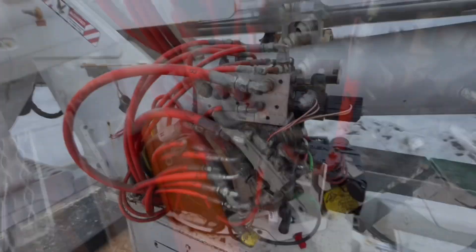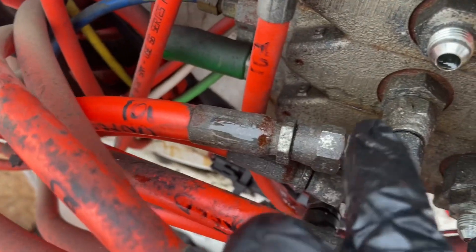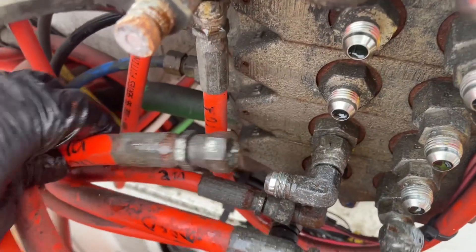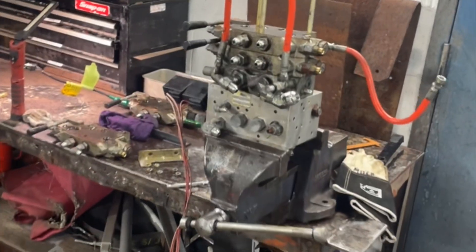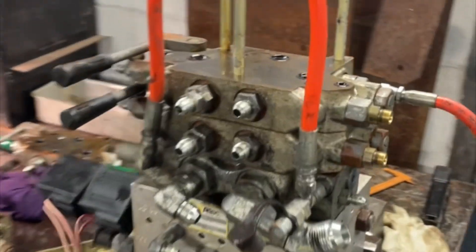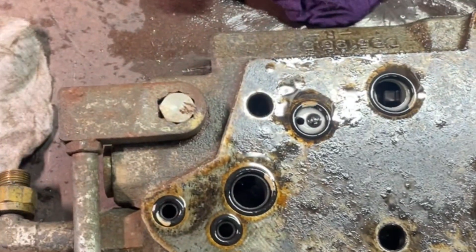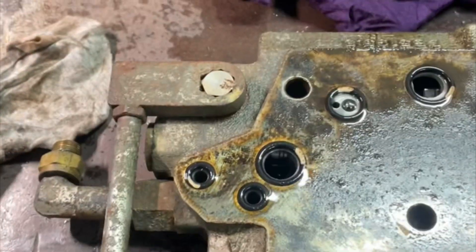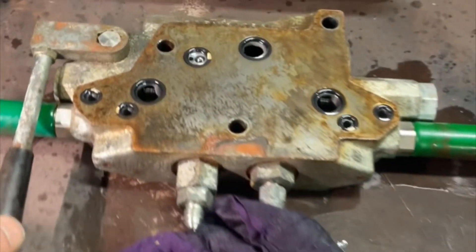So 102 goes here, 101 goes here, 200 goes down there. We got the valve bank on the bench, all torn apart, and we found the source of the leak. We got the rebuild kit, we got the manuals, and we're going to disassemble everything — including all the levers — basically do a full overhaul and bring her back to factory specs.